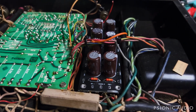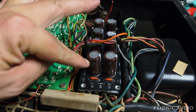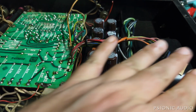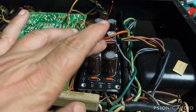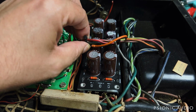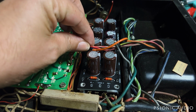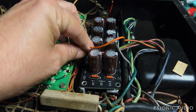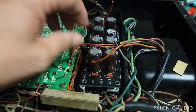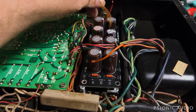But while I'm going from the 5/8 standoffs to the 1/2 inch standoff, so all these will be an 1/8 of an inch lower. So this will be even lower, but there's plenty of clearance even with this. My calculations were correct. I think it'll just look better to be a little bit lower. And on some amps, this bundle might be tighter, so that little bit of excess will be nice, even if there is that gap there. I intentionally left that gap there. So I think this will be very easy to do, and these old wires will go right in here.